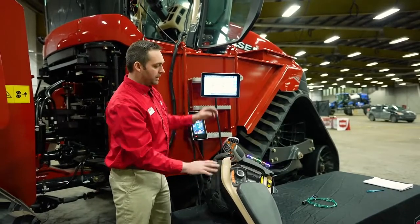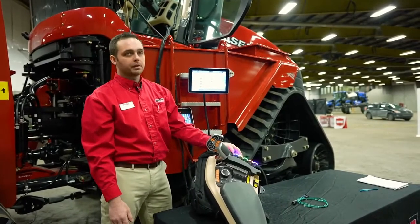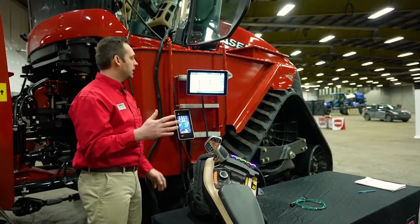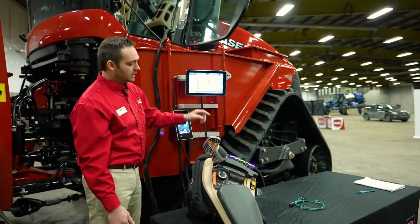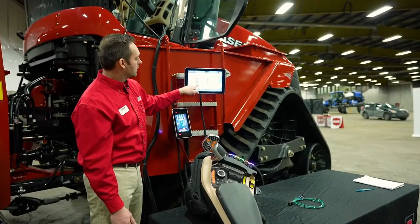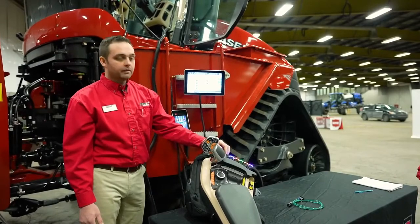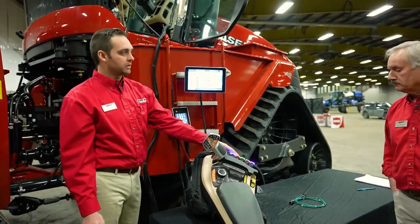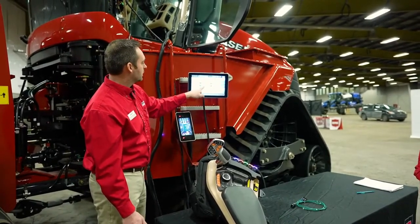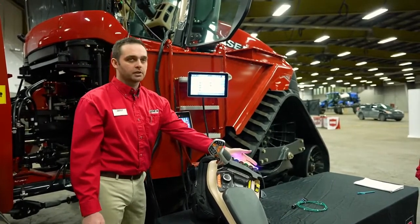So with these new hydraulics, we can actually move remote valve 1 to remote valve 3, for an example. So if you actually plug the hydraulics into the rear of the tractor not quite how you intended, you can actually take number 1, the red valve, and move it to number 3 position simply by going into the 3rd position, selecting valve 1, and we have now moved the red valve, which is always valve number 1, to the 3rd position. Number 1 is now not assigned, but I can now put remote valve 3 into the 1st position, and it lights up yellow. We can do that for all 6 remotes.